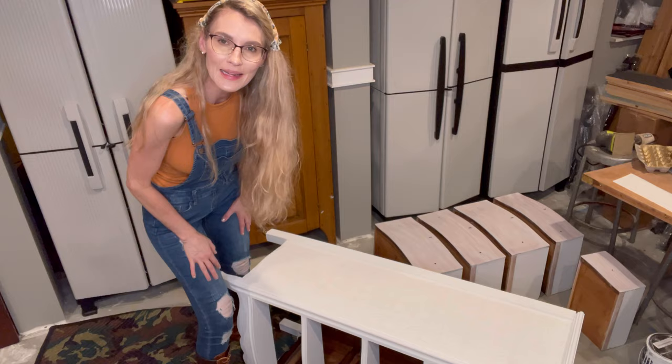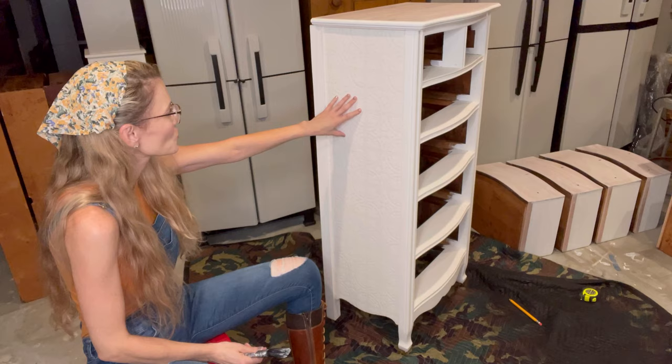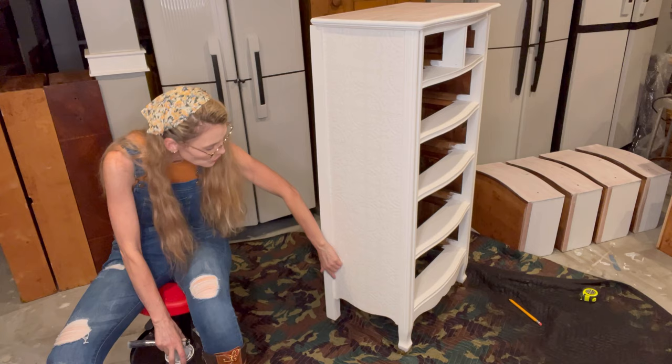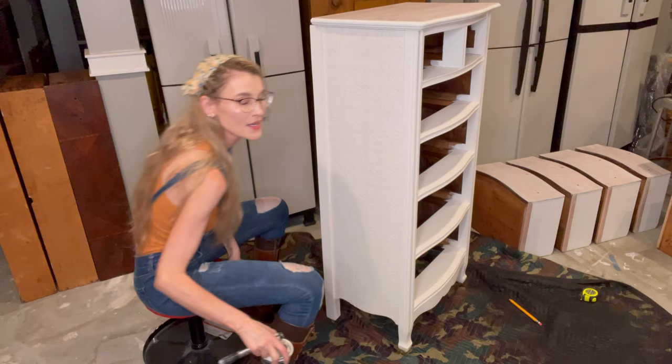Okay, you guys, I'm at the home stretch. I'm about to paint the textured wallpaper. I've let the adhesive dry for a little more than an hour, and you guys, look at this. The X-Acto knife method worked. Look at that. So now I got the textured wallpaper to just go right around that curve right there perfectly. So if you end up having not a straight edge, it works as well.